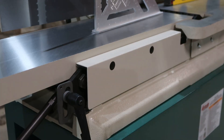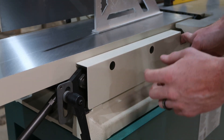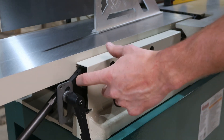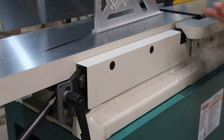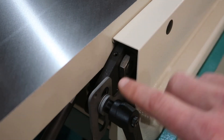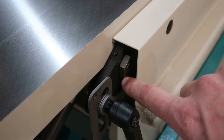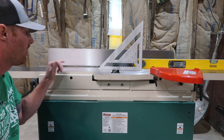If you need to make adjustments on your outfeed table, you're going to have to remove the guard. There are two eccentric bushings underneath — you can see one of the nuts here and another one up here. You'll just have to pop that off and then twist those clockwise or counterclockwise depending on how you need your table adjusted. Once you take the guard off, there's a set screw inside that you'll have to loosen before you can spin the eccentric bushing to make your adjustments.